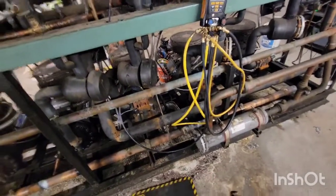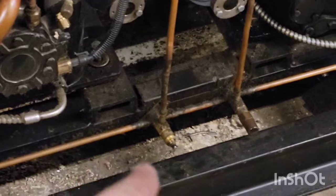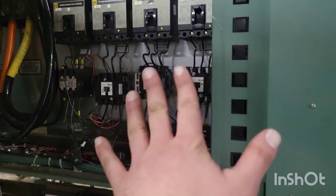This is a failure of step number 13. You can see we're at 170 psi. So you can see that the suction is closed. We can also see that the oil is closed, right there. And then the discharge is the only thing that's open. The compressor is tripped currently, and it is off at the control voltage as well. So we can see that it's filling up with discharge pressure.